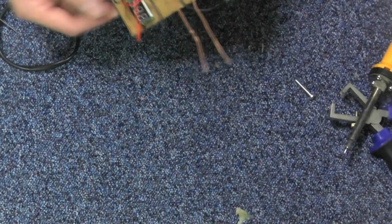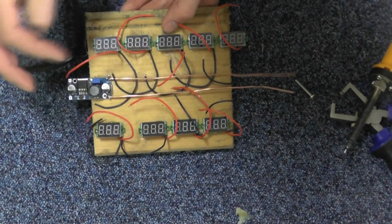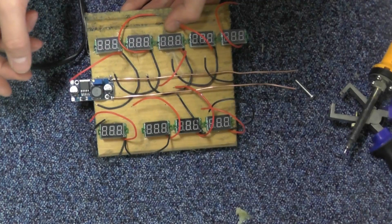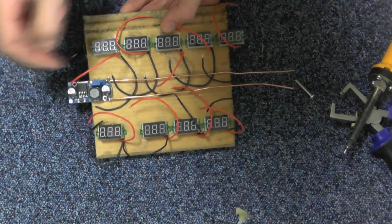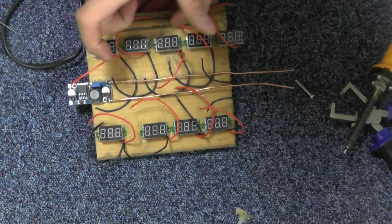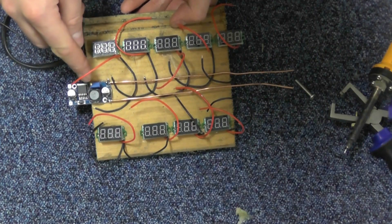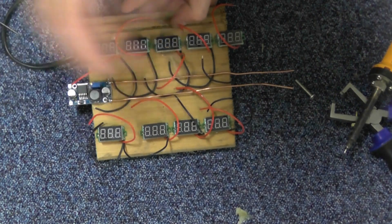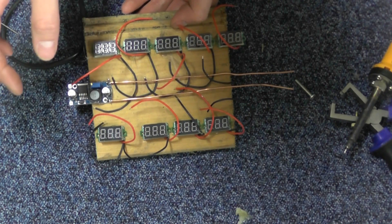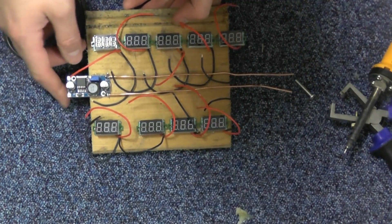I've developed the idea a little bit further in my head and I've found a boost-buck converter. I'm going to put two little rails all the way across and solder all the little leads to it, rather than trying to squeeze all nine leads together at once. That way we can keep the leads as long as they are — just a little dab of solder to keep it on. There shouldn't be any volt drop across this because the resistivity of the copper is negligible at this length with no load. We can then wind the pot up and down and see if they all remain at the same voltage at the same time. It's not going to look pretty, it's going to be functional — functional must be my middle name.